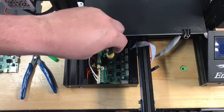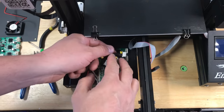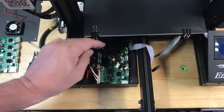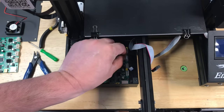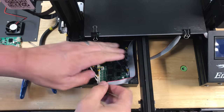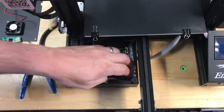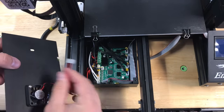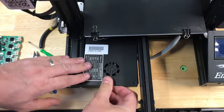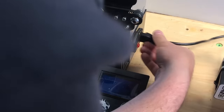Now I just need to remount this board. I put all four screws in loosely and then went back and tightened them so the board was firm. The stepper motor cables have a label on them — like X — and I match it up to the X connector on the board. The board itself shows X, Y, Z, and extruder, so I just checked the label and put it in the right position. The final connector is the LCD ribbon cable — just follow the bend and it naturally goes into place, and the connector is keyed so you can only put it in one way. Then connect the fan back up on the cover, put the cover in place with three screws — two at the front and one at the back, which requires sliding the bed forward to access.